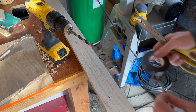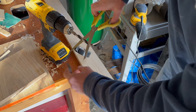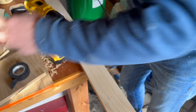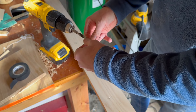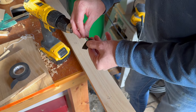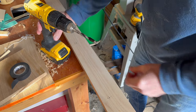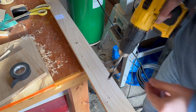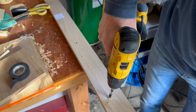I'm now going to drill some holes in the side. The holes are spaced exactly where the spacers are between the door frame and the beam so that will give me nice fixings. Now this is a little tip that I saw somewhere - I think my dad showed me it actually. Put a piece of tape around your drill bit so you don't drill in too far. The oak is only 20mm thick so I don't want to go too far, so I've marked that at approximately 10 to 12mm. Once the tape stops against the wood I know I need to stop drilling.